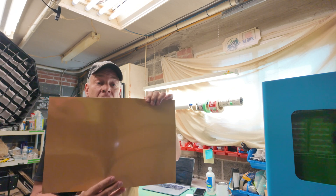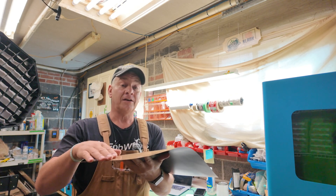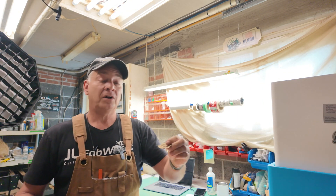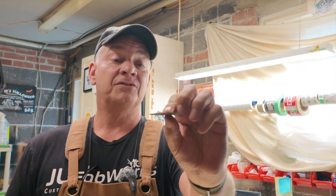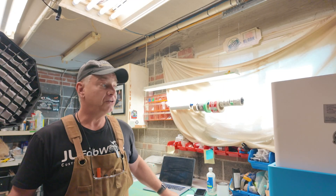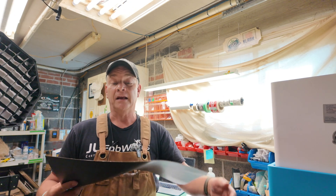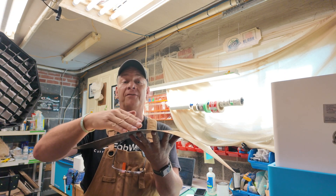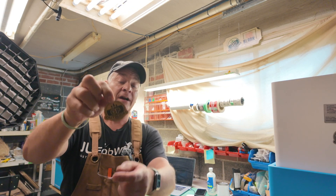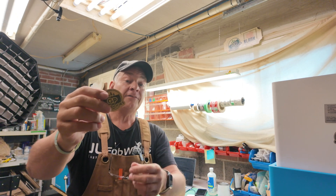If you're looking to try the gold Lasermag, I found a couple of interesting differences. The gold has a much thicker layer — almost like a plastic or silicon coating on it. The Aurora Lite will engrave it and cut it, but you'll see there's slight lifting on that plastic coating, which for some reason the silver coating doesn't have. If you're doing a lot of engraving on that three-by-two sheet, you may find that this layer starts to lift and puff up. I was surprised that the Aurora Lite actually goes through that plastic layer and engraves the metal underneath without damaging the plastic, but it will definitely start to lift it.